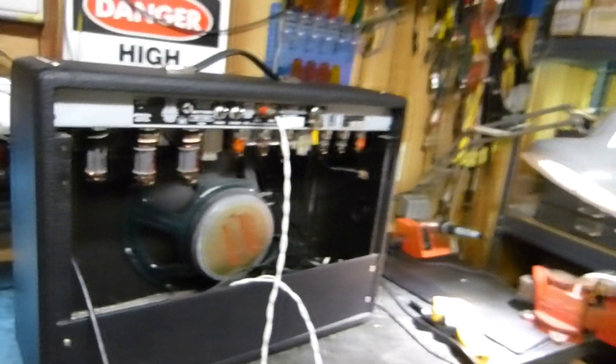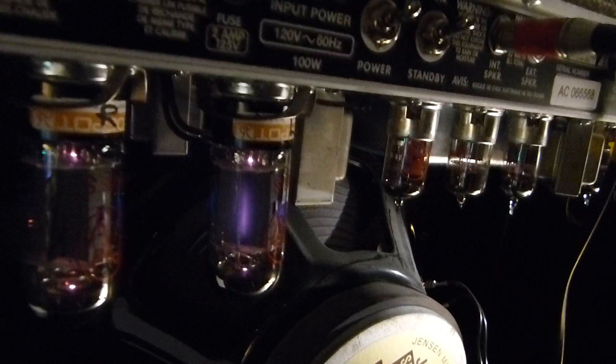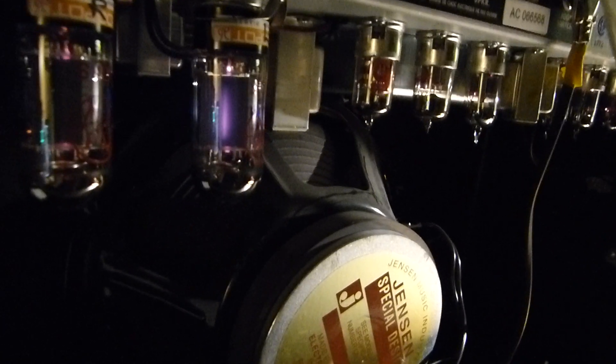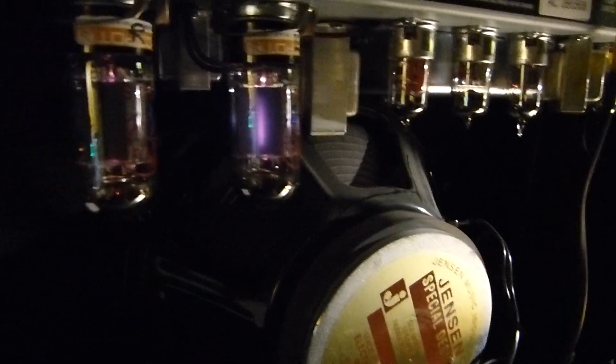Let me turn out the light and you'll see even more. Watch — that tube is starting to turn red. It looks blue in the camera but it's actually red. It's just a bad tube socket, and it's probably on pin 5, because it's likely losing its bias voltage. There's its output again.